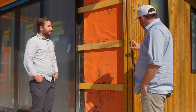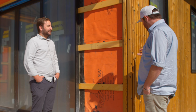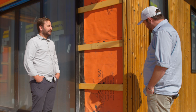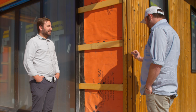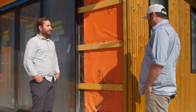What about these corners? We don't always recommend mitered corners, but with this profile, it's hard to cap them or do any type of inside aluminum corner piece. These are very tight seams. The installers did a great job. I think with the stability of this wood, you're not really going to see much movement on here. That's one thing we're concerned about with traditional cedars or traditional wood siding products. You can get some shrinkage, especially in this climate, and have that open up. But these are really clean and just look amazing.